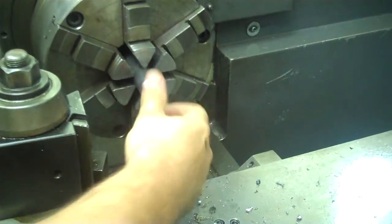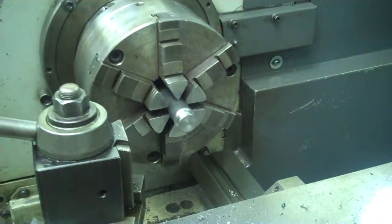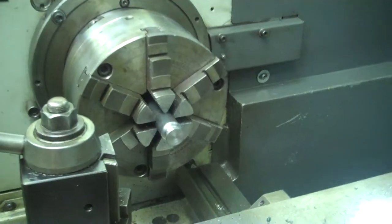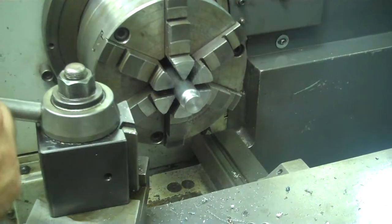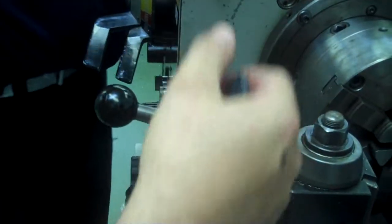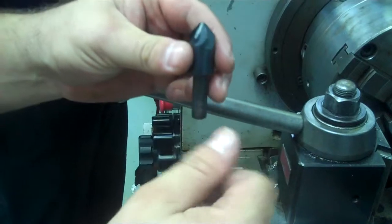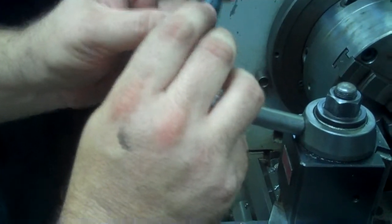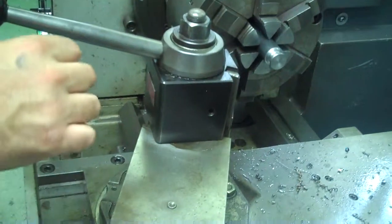Now I'm ready to drill. I have to drill my part to 5/16ths, so I'm going to get my 5/16ths drill. I'm going to center drill it first and then drill with the 5/16ths drill. I'm also going to use a countersink tool — this is a 5/8ths countersink, so at the largest diameter it's 0.625. I'm not going to sink it the whole way in. I'm going to grab my center drill because I want to center drill this first.